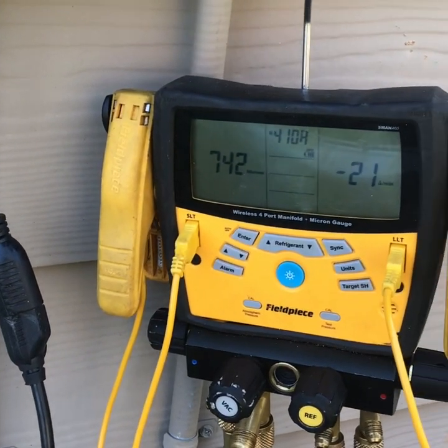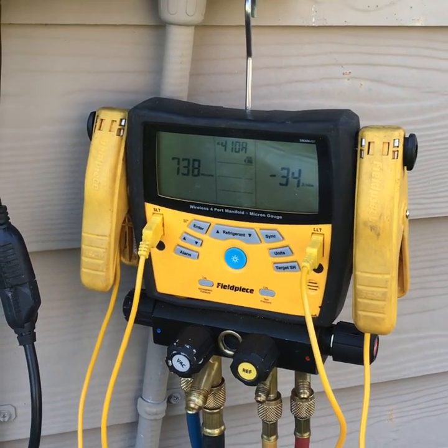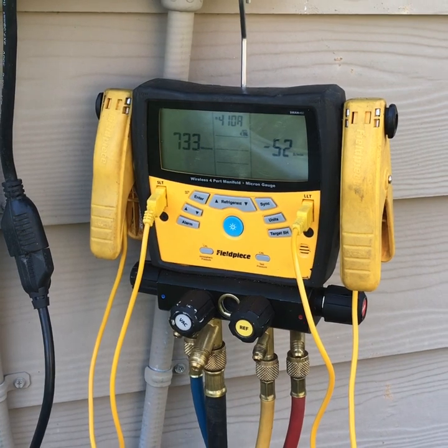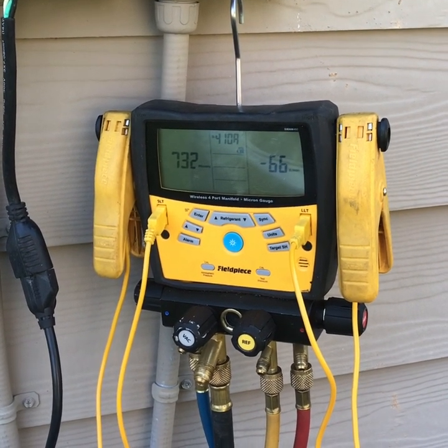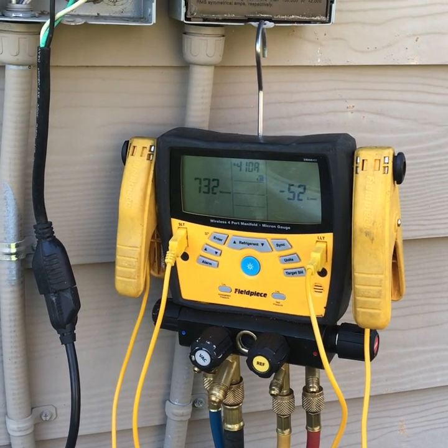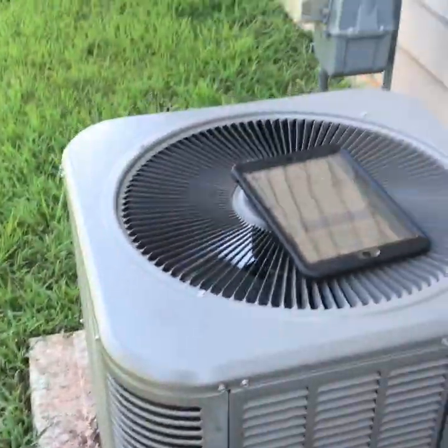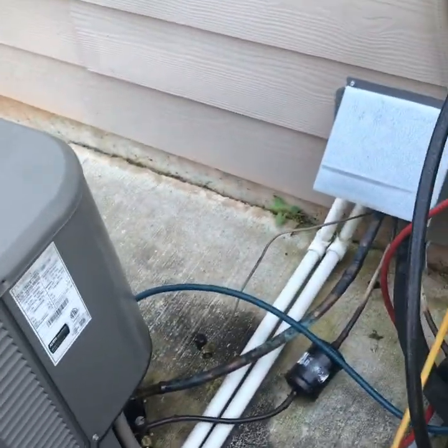It's been about 30 minutes, we're down to 740 and dropping. It'll slow back up in a minute and then sit there for a good while. We got the vacuum pulled down to about 600 microns - about as close as we could get without being here for four hours. All together it's about 50 minutes of vacuum time. Now we're going to add the refrigerant. This system holds three pounds 15 ounces, so four pounds and then probably five or six ounces for the line set.